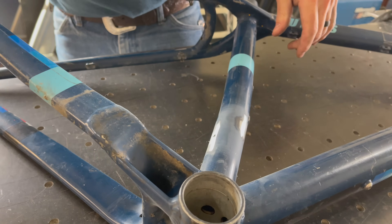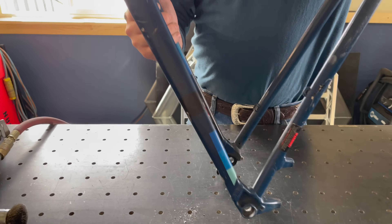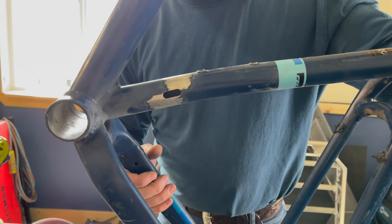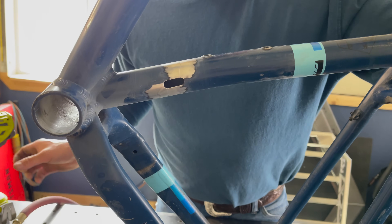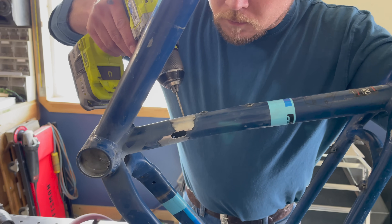Tell me again the purpose for drilling a hole to stop the spread of the crack. So you just put it right at the end of the crack? Yep — right where the crack ends, as far as we can tell. Punch a hole, and then it shouldn't spread any further in the future.